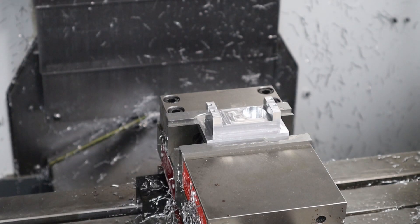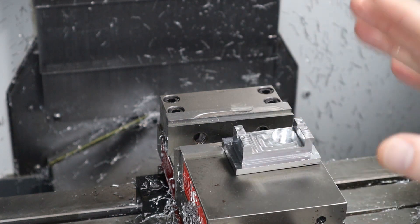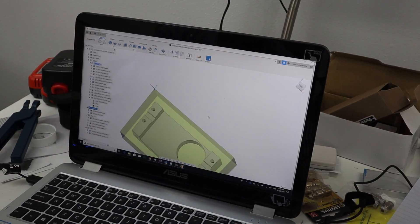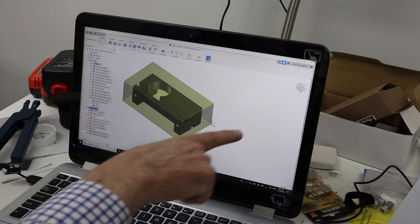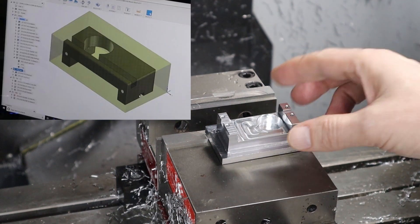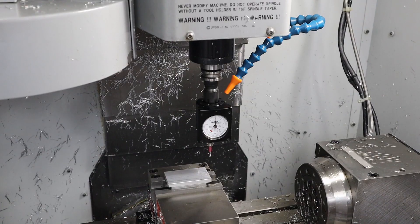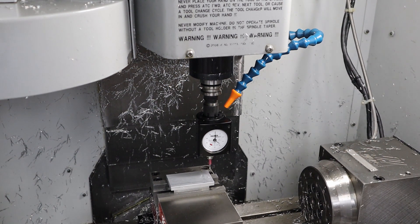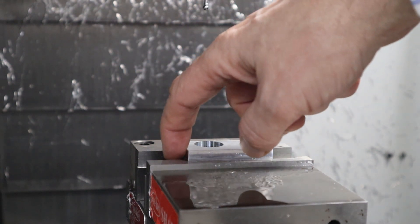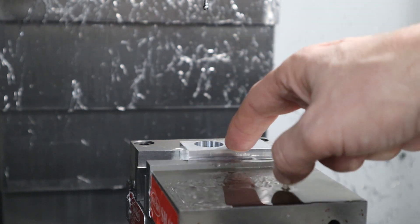The first side is done. I'll take it out of the vise, flip it over, and check my screen to see what the coordinate systems are for the next side. I'll click on the top cap, then flip it so that X is heading this way and Y is that way — the coordinate system I want is the back right. This hole is going to be on the left side, so I'll flip it accordingly. What I'm going to do is pick up the left side, set this to G54, pick up the right side, set this to G55, and then add and divide those by two to get the center point.